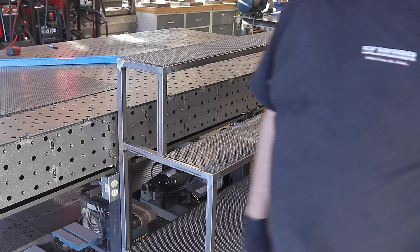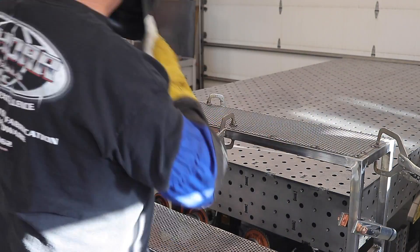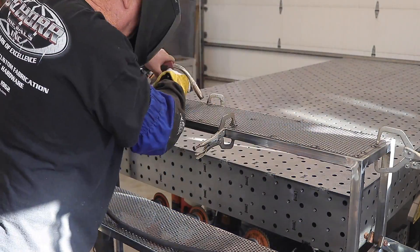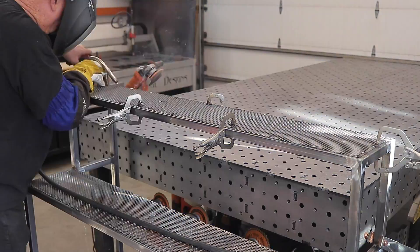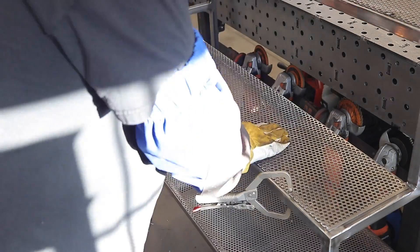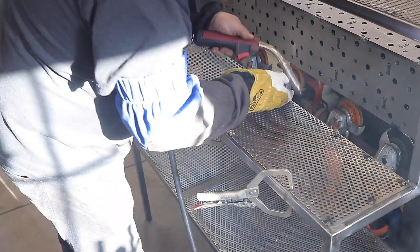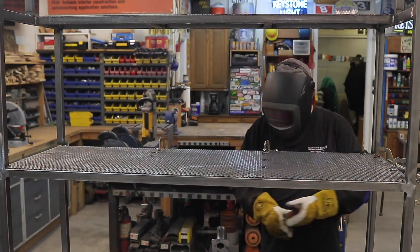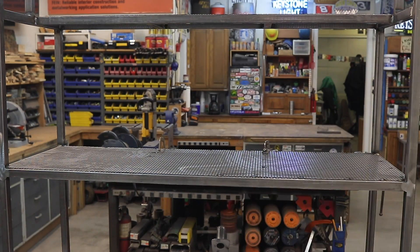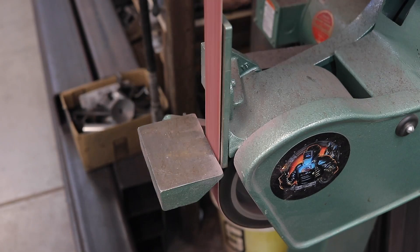All pieces are set in there. I found the best way to attach the sheet metal is with spot welds about every six or eight inches apart — I just filled in the little quarter-inch hole diameter with a small flat bubble. It worked out really good. I'm using clamps to hold everything nice and tight while welding; I've learned the hard way that if you don't do this you have problems. You can never have enough clamps.